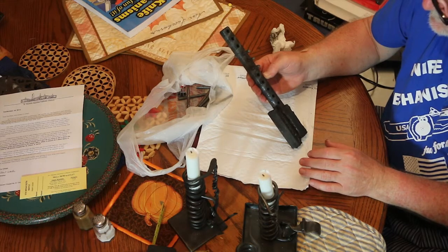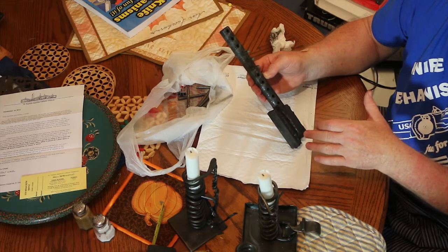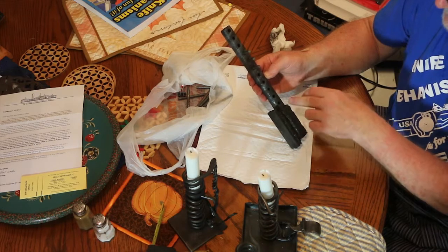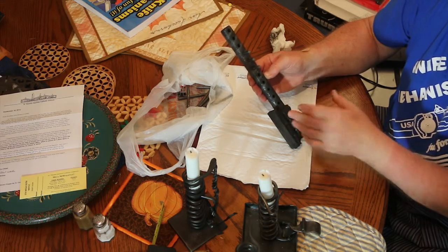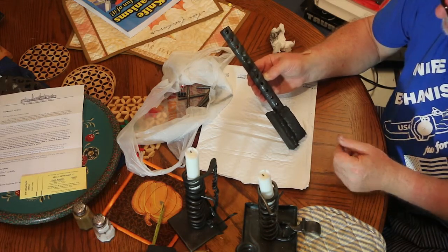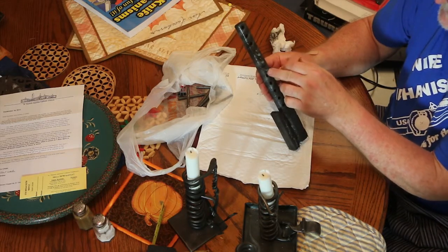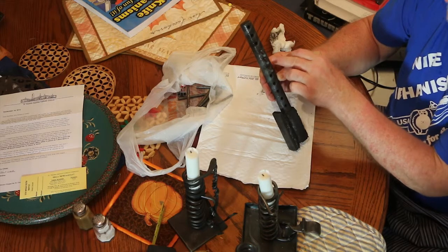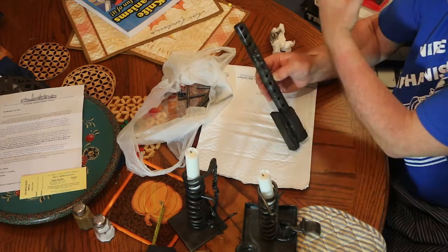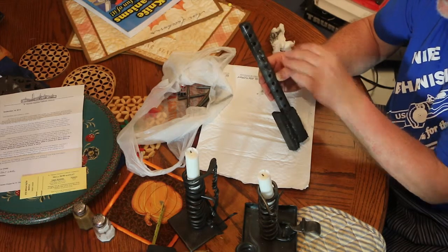One thing I discovered was that for me it was too hard to do it in a coal fire, so I got an acetylene torch and was wrapping it that way. First I got the rosebud, and I think somebody changed tips so I was just using a regular tip. A key to this is when you're wrapping this around, you have to keep the heat right where the bend is. Because if you just lever it around, it's going to go off on a tangent and the comeback is going to be kind of square-looking. So keep the heat right where you're turning.